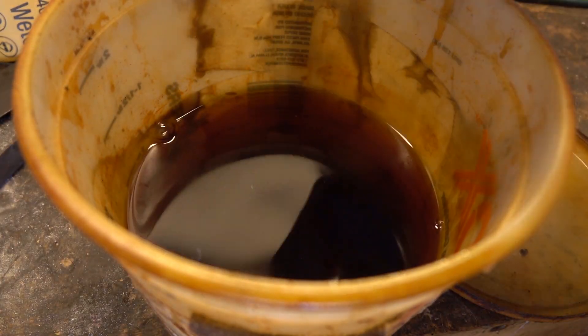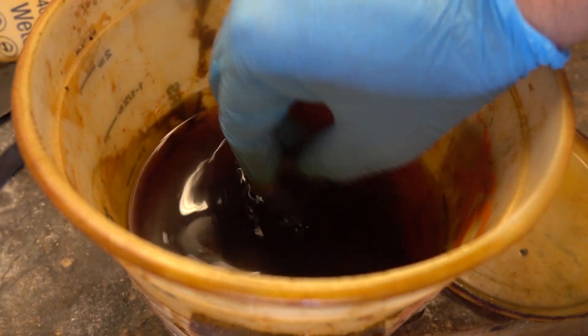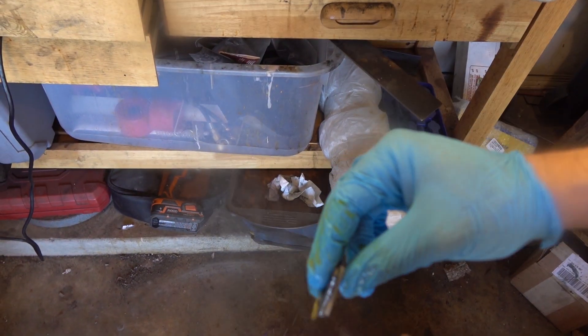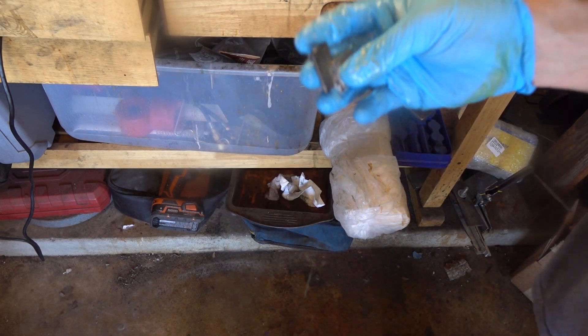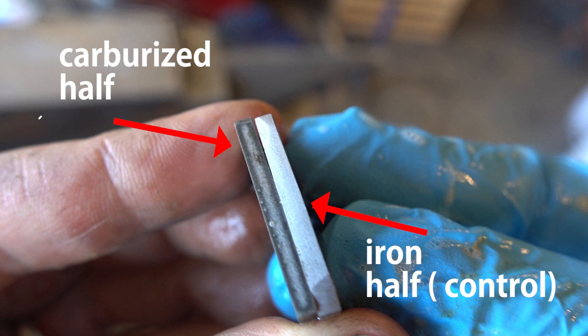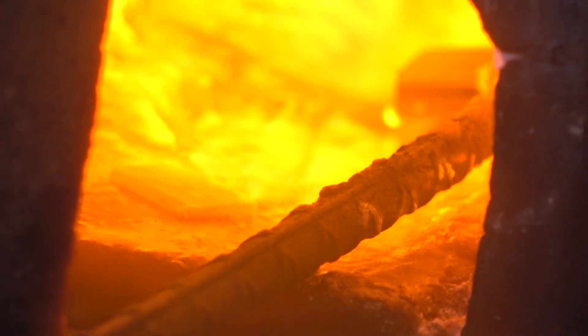That is ferric chloride acid and ammonia. There's a lot of carbon about half a millimeter in from every side, as you can see, which is less than I was hoping for. But I think if you compare that center stripe of the test piece to the iron control piece next to it, it is a bit darker. So I think that carbon, to some degree, penetrated throughout the thickness of our test piece. Not the greatest — but we're not beat. This is America.